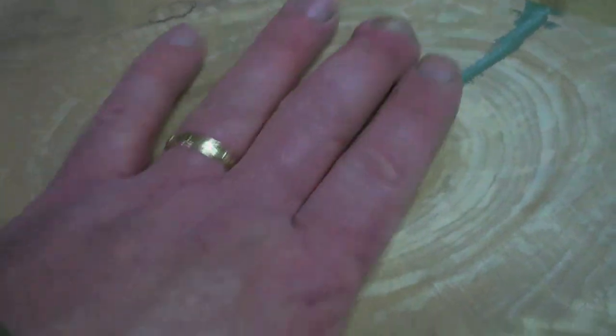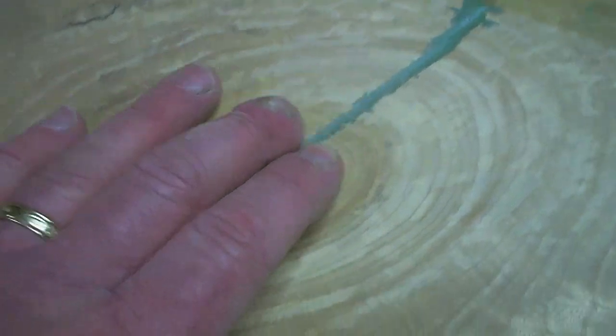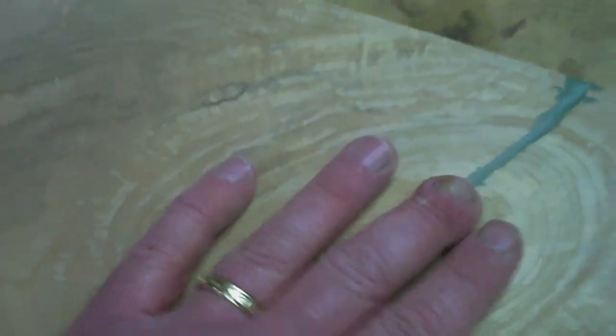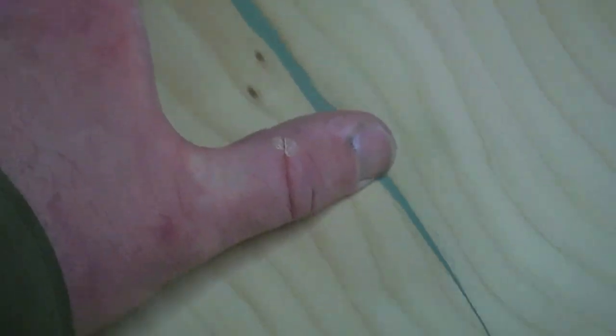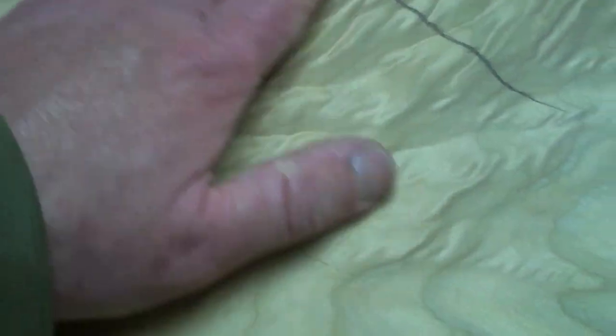At first glance the color experiment didn't look good — the tape bowed in instead of bowing out, which is unusual. Usually the pressure pushes it out, but this time it bowed in and left me with divots. After a little exploratory sanding, the bleed-out cleaned right up. So this is leaving that crack filled with a seafoam green — a 1950s kitchen green. The others were filled with clear but I got a number of bubbles and protrusions from filling it from the backside; it just didn't work quite right, so this will have to be refilled from the front.